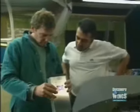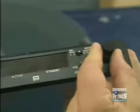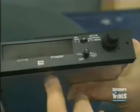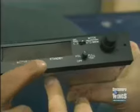Next is the radio. It's a VHF comm radio. It operates between 118 and 136 megahertz, and there's 25 kilohertz spacing, which gives you the 760 channels. You can actually set 10 frequencies in the memory. So if you've got a flight plan and you know you're going to go through different spaces and use different frequencies, you can preset the frequencies into the radio. By pressing that button there, you can just select 1 to 10. Looks the business.